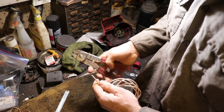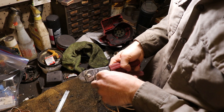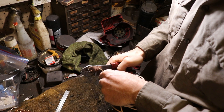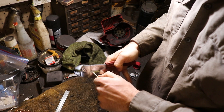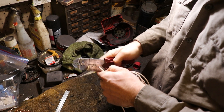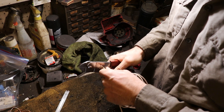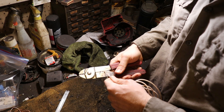Another way of doing this is: if you have existing wires, go on here and start at one of the bigger ones — that one doesn't work, go down. That one cuts into the insulation but doesn't fully cut through, so you can't pull it off. You should be able to just pull this off. You keep going down — that one pulls it off. That was 14 gauge.